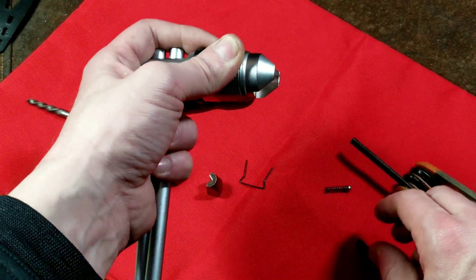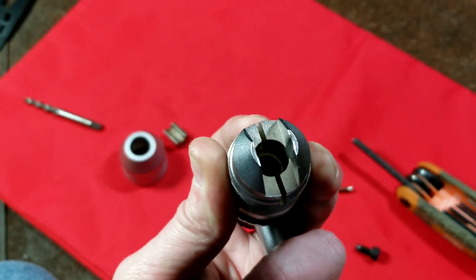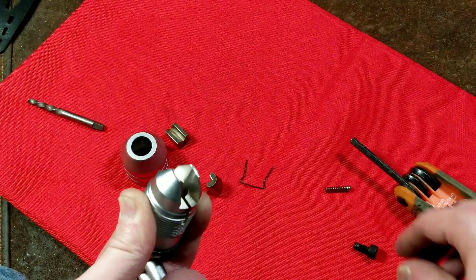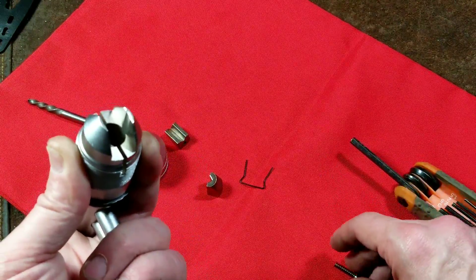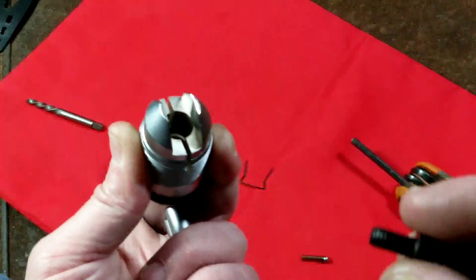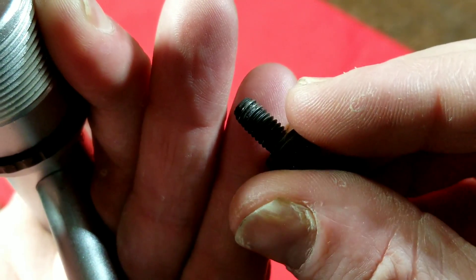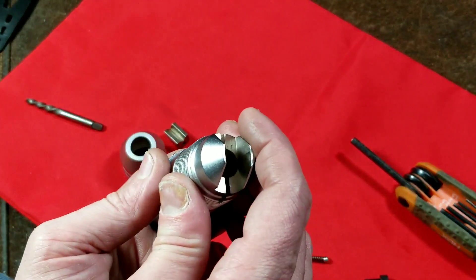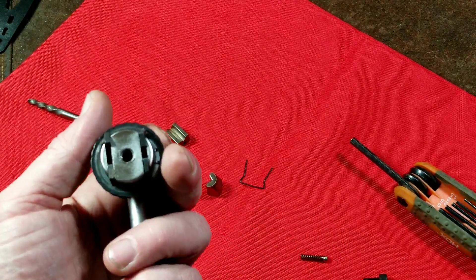While I was correct about the hole and ball detent for the bottom handle pointing upwards, I didn't realize they had drilled the hole all the way through and the end of the screw was holding it. Here's the spring and ball bearing for the lower ball detent. I'm seeing evidence that something damaged the threads — that's why I was having issues. Let's pull this little mechanism off.